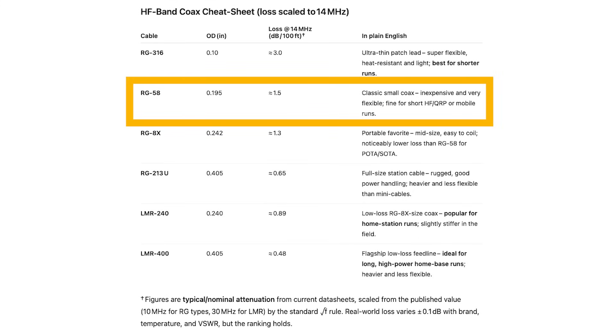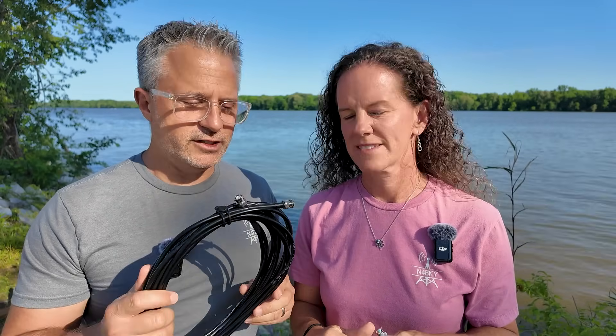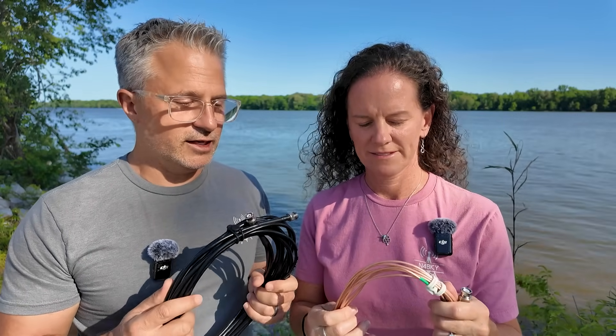Also RG-58, which is one of the most popular ones, is a little bit more flexible than the RG-8X and very, very similar. The last consideration is where you get it from. Several people have bought multiple different coax cables, and if you have the ability to measure the loss that would be great, but we don't. If you get something from Amazon or eBay, it can be questionable. There are people who've gotten the exact same kind of cable and found the results were not very stellar. You can get one from a reputable brand. We've had great luck with this one — we'll leave it in the description below — and from what we can tell, it outperforms the cheaper options.